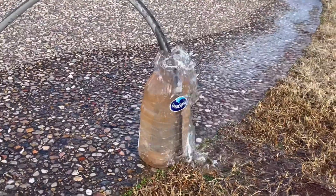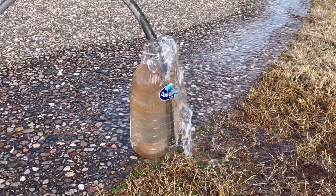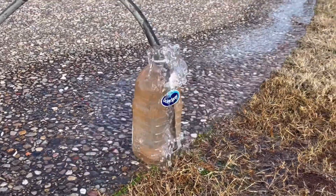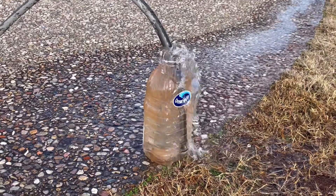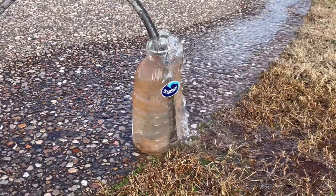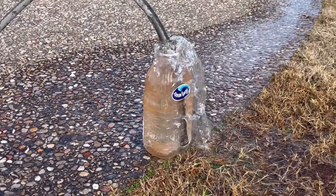I should have prefaced those remarks by saying you don't want this brown water going into the house — you don't want it going into your shower, your dishwasher, your washing machine, your faucet fixtures and so on. So once you turn the well back on or you open up the valve back into the house, before you run any water in the house, before you run any fixtures or appliances, open the hose bibs until it runs clear. Once it's running clear, then you can feel free to start using water in the house.